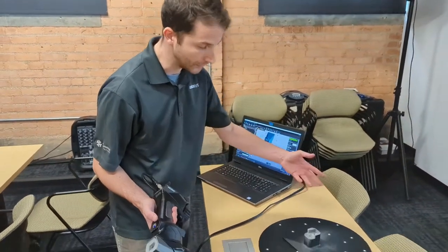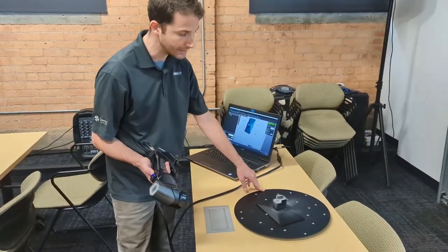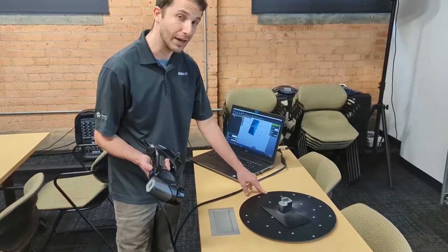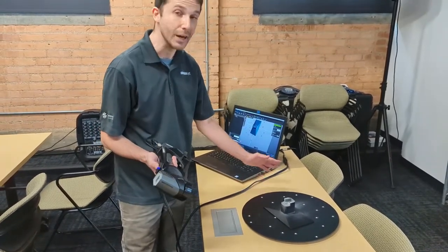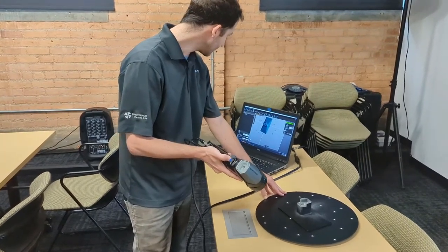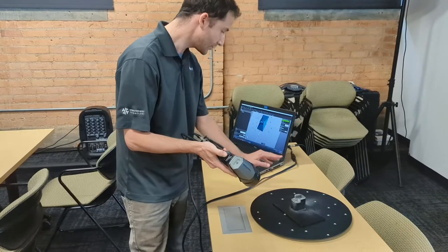What's cool about the sub spray is it goes on like a powder — it looks like a powder when it sprays onto the object you're scanning — but over a couple of hours it sublimates off into the air, so there's no cleanup involved. That's awesome! So I'm just going to restart our scan without generating a new scan.